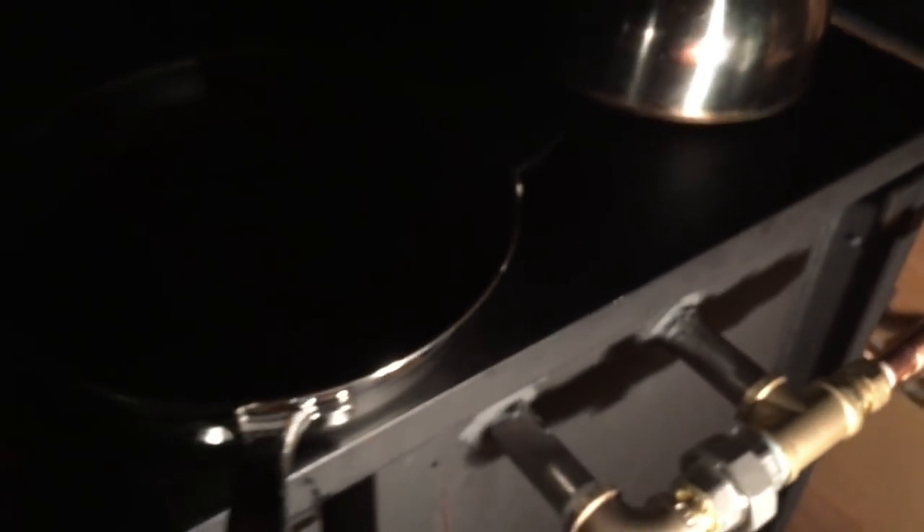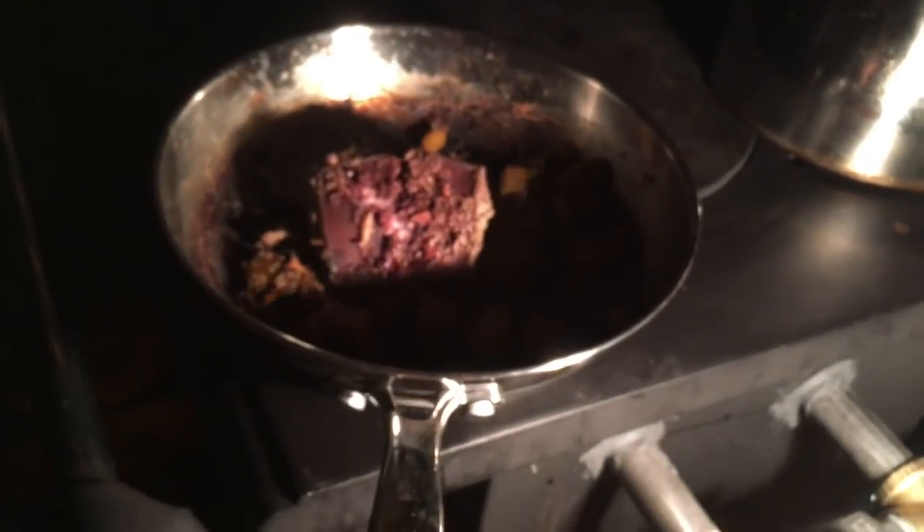Is the Stanley as efficient as the Essie? No, but it has some unique advantages. If you're heating more space than you can heat with the Stanley, the Essie's great. It does have a higher BTU output — there's no question, it's a bigger firebox and a more efficient burn, a more efficient firebox.